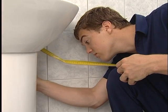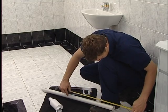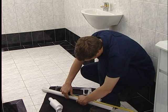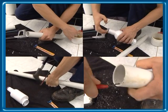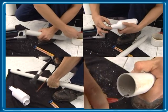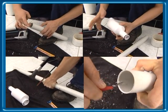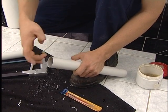Firstly, a measurement is taken from the engagement of the bottom fitting to the thread face on the top. Then deduct 205mm or 8¼ inches for the trap. Cut the pipe to this length, ream the inside of one end of the pipe, and lubricate. Put some lubricant on the o-ring as well. Liquid soap is handy for this if you don't have the proper pipe lubricant.